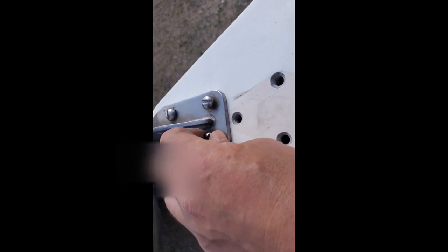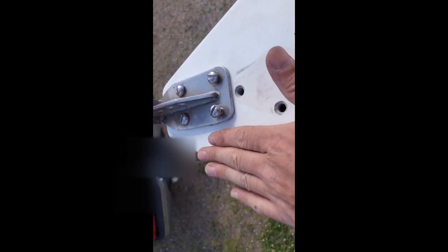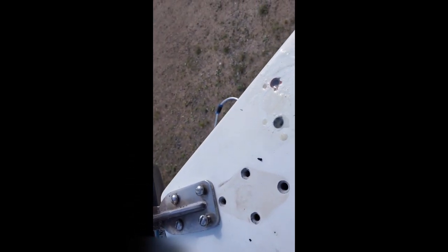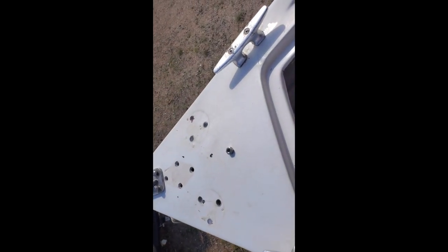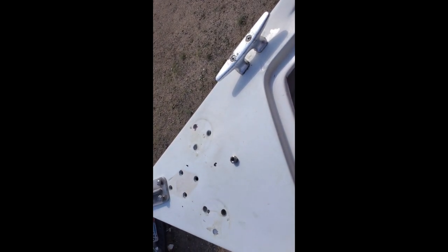We have the chain plates or backing plates in. It took me a while to get that front one — it's a little bit narrower and I had to grind it just perfect to get it to fit. I'm pretty happy with them now. I'm going to get these taken out and put some masking tape on the back, then fill in with some wood-penetrating epoxy so it goes down into the core and makes it nice and strong, then get everything tightened up. I hope this helped you out. Let me know in the comments if you have any questions, hit that like button and subscribe — it helps us out. If you'd like to check out our Patreon, it's in the description below.